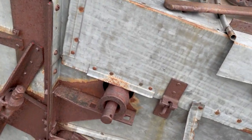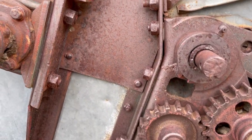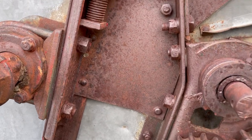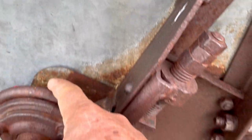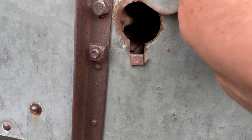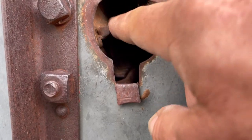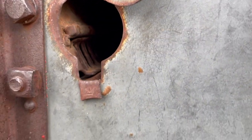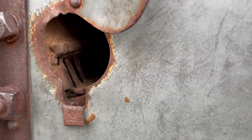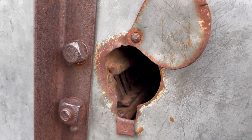Now the reaper part — this would have had some kind of markings on it I believe. This mechanism moves the cylinder up and down. Here you can see what the cylinder rubs against — those are the concaves — and there are holes in there that allow the grain to fall through as the cylinder strikes it and shatters it.